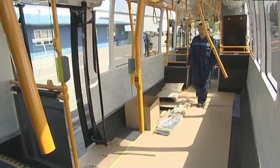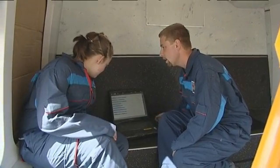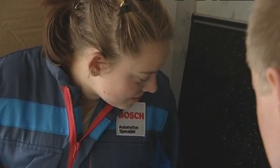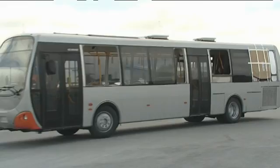With the doors working, it's time to electronically monitor the engine and make sure everything is operating smoothly while the bus is running. This screen allows us to check all the temperature sensors to see how hot or cold the engine or gearbox are getting, so we can keep an eye on that as we're driving around. From the monitor values, everything looks pretty much in sync. What I find interesting about this job is you get given a job, something doesn't work, you get to play around with it, work out how it's supposed to work, then you fix it and send the customer away quite happy.